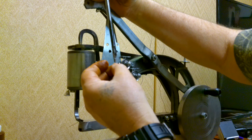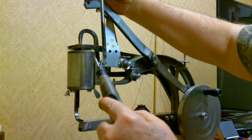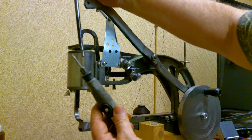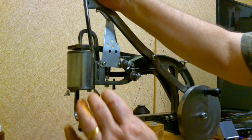You want to make sure it fits up in there snugly. Be kind of careful — you want to evenly cut this out. Don't cut too deep on one side and not deep enough on the other, because then your needle will sit at an angle. You want it to sit parallel with your needle bar, perpendicular to the cutting direction. That's the key part of the modification.